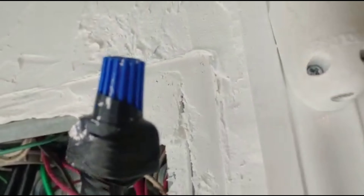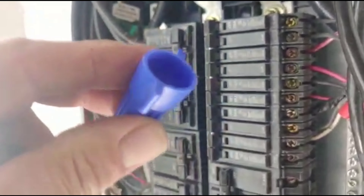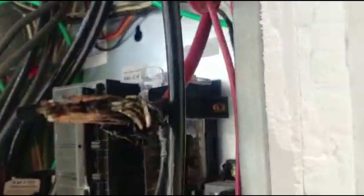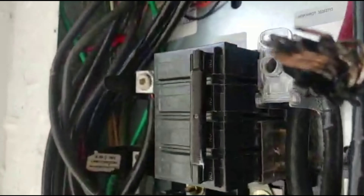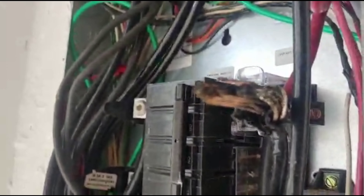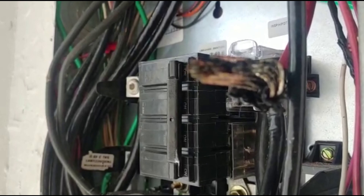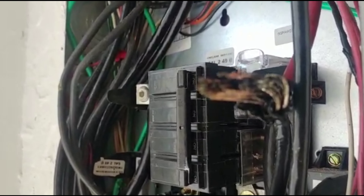This old connector — one side was a four-contact type. If you don't do it properly, the wire technically just sits loosely inside this little fitting. You can see versus the wire — no way in hell the wire is going to seat properly in there. So it creates poor contact, and because of that it creates a lot of heat at the point where it actually melted the old wire nut. The best way is to use the special copper-to-aluminum connectors.